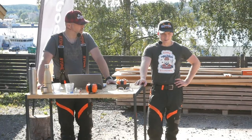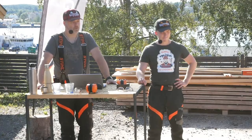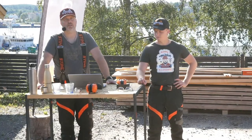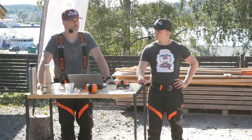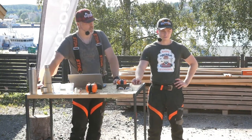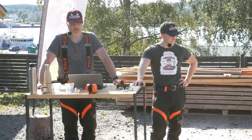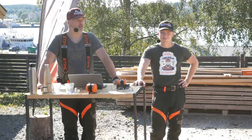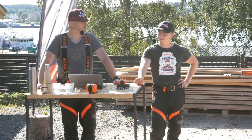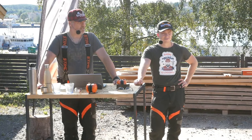What else? We have the lifting system. You have a stronger gearing system in the F2 Plus. And the increments of 1/4 inch make both sawmills really easy to use. And you can take the curve into account by using the built-in lifting system, the click system that we have. So it works the same on both of the models. Even though we are a bit stronger on the F2 Plus, since we have another ratio for the lifting system. So both sawmills are very easy to use. A chainsaw mill in terms of surface finish and straightness of the cut is phenomenal and can't be compared to a bandsaw mill, actually, if you want to mill these dimensions of logs.